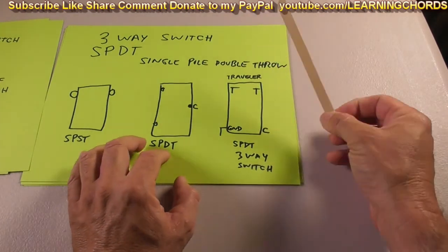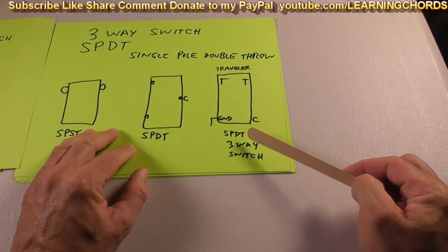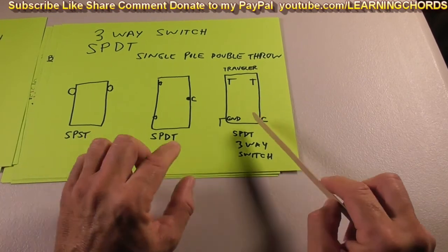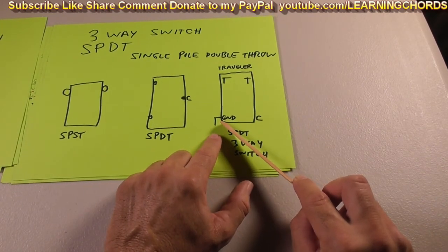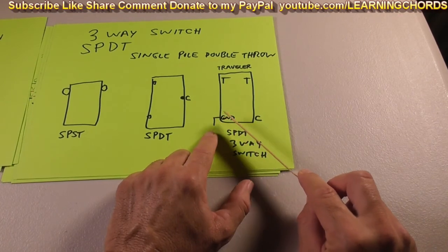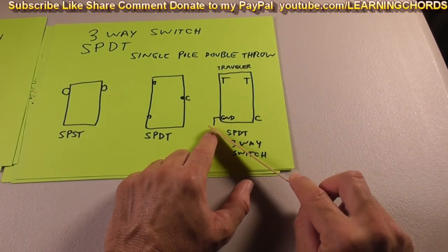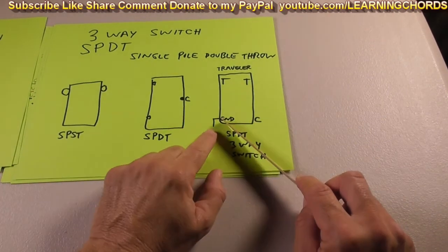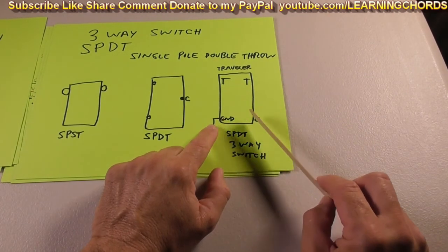And now we are going to go over to the three-way switch, which is really an SPDT. We have the ground over here. It does have a ground, like I showed you with the other circuit. I'm not going to talk about that now, but the ground should always be connected from your power to the box, to all the other boxes, to the light. We're going to leave that out for the rest of this conversation, maybe.